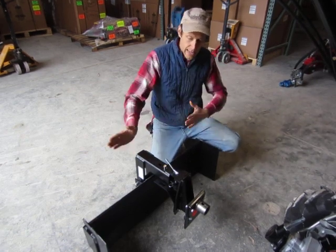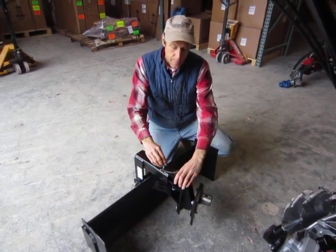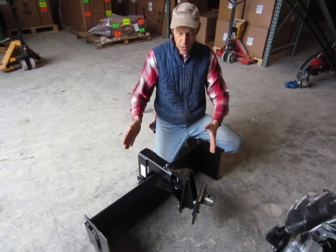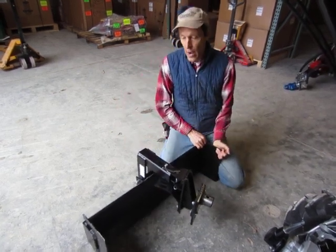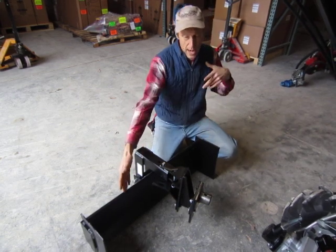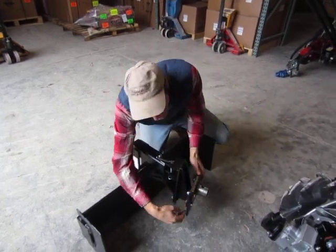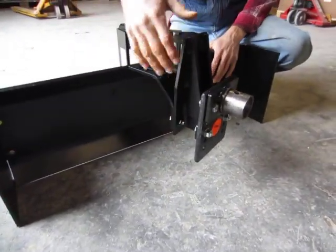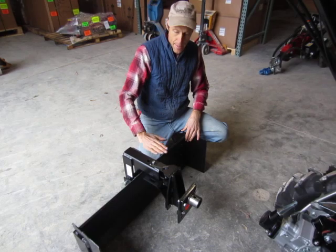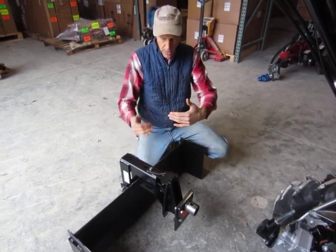When you're trying to angle the blade sideways — there's a little pin you can pull to actually angle it to the front or rear of the tractor — if your blade is already angled because your tractor sits higher and you swivel the blade to the side, it'll be up off the ground. The pivot angle is no longer perpendicular to the ground, so when you swing the blade one end is going to dig in. We said that's dumb, so we came up with a leveler plate made of half-inch plate steel with about seven holes so you can select whatever height is right for your tractor, keeping the blade frame parallel to the ground.